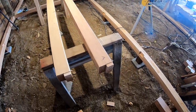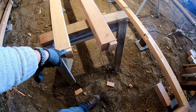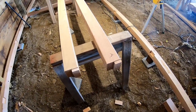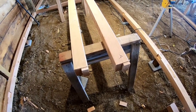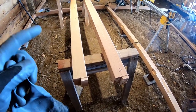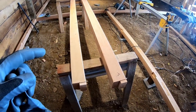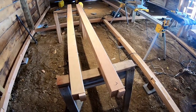For these two intermediate girders, I took the trim router and knocked off a fat eighth so that they fit in the mortises. This was easier than widening the mortises. I'll probably have to do this to all of them, although the other four-by-fours are all over the place in size — which is to be expected — so I may have to measure each one individually. Let this be a lesson: always order all your material from the same vendor, check it before you accept delivery, and check a couple different spots.